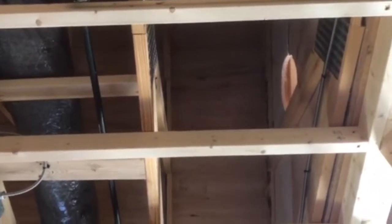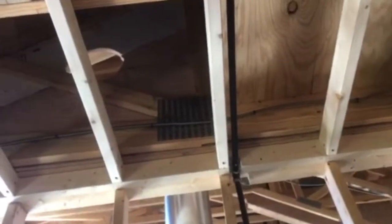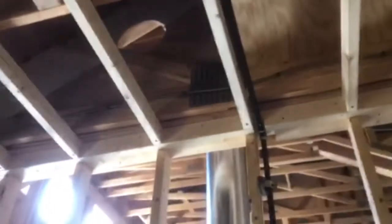I just wanted to show you what it really takes. Notice there's structure on the back side — this truss. We have to make sure to miss that. We're going to have to build a little bit of framing to support the wall thimble, which is an approved penetration fire stop.